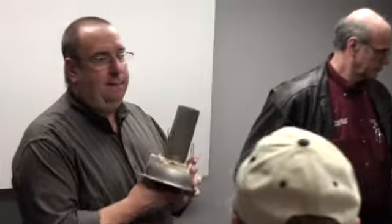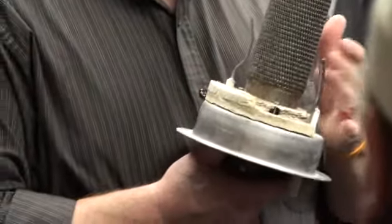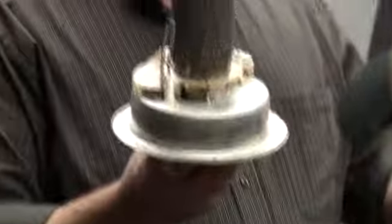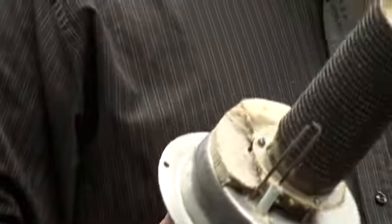You never have to adjust the spark gap on these. I worked with a lot of wall-hung boilers when I was still in the trade where they'd get you in to change and check the gap every year because it would change. These have not changed, so don't mess with the spark gap. The flame rod - if you pull it out and want to clean it, use a dollar bill, paper money. It works the best on any flame rod. Leaves no residue, doesn't groove the steel, and cleans it in good shape.